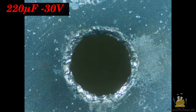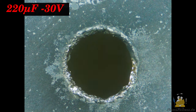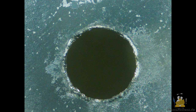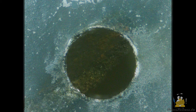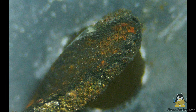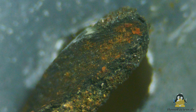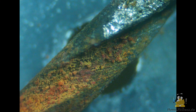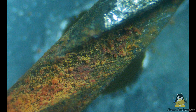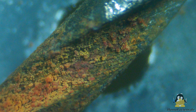Steel does not only consist of iron, and the water molecules also contribute to a whole series of redox reactions in the vat. The diameter of the finished hole is slightly smaller, but not because the spark gap is smaller, but because the drill has become thinner. The iron oxidizes at the anode and so metal ions dissolve. These redox reactions do not take place in the plasma of the sparks, but on the entire surface of the drill that is immersed in the water. A rust red layer can clearly be seen on the surface of the drill. There is a lot to tell about the problem of tool electrode erosion in upcoming videos.